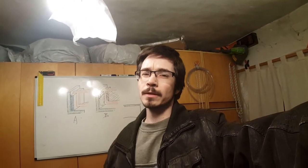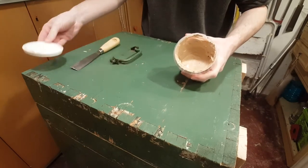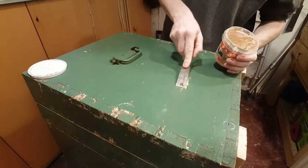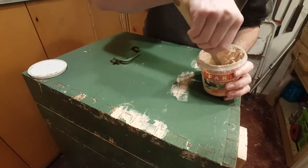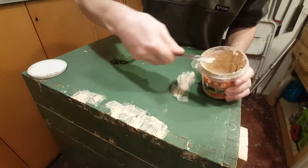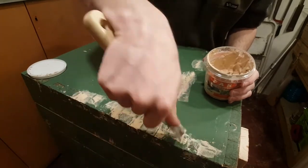And then there is one more thing we might want to tackle. Let me show you. Actually, before painting, you might notice a number of imperfections in your wood. And for that, you just use wood filler. It's this gooey putty, basically. And you just apply this into the wounds. This does not only hide the imperfections, but also helps when painting, because it would be easier to paint afterwards. You can use it to fill in cracks, or cover nail holes, screw holes, bug holes.